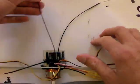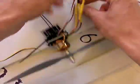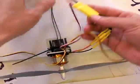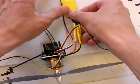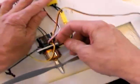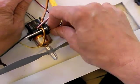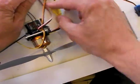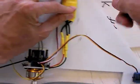Okay, and then next what I want to do, I'll do the antennas later. So this is where I set the receiver, which kind of determines where everything else goes, because it's the brain center and everything connects to it. So speed controller's next. You kind of want the heat sink to be up, and I like to put it off to the side here, just so that these are kind of out. I don't want them resting right up against the motor mount, because I might eventually wear through and cut, so I just leave it like that, with a little bit of room, and then we just put in a couple of holes.